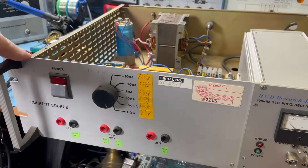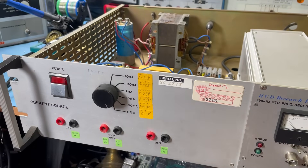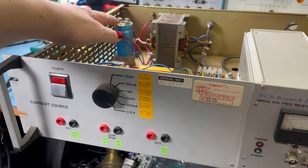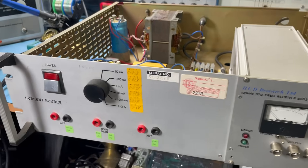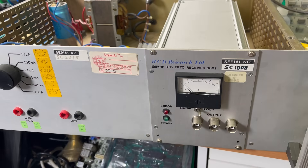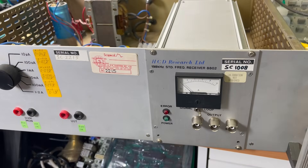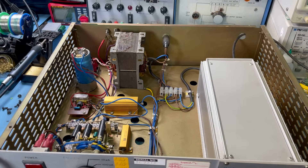Shame they're switching it off soon. So I've already got it over on the bench. I've got the lid off — let's dive in and take a look at what I've got. It's a rack-mounted current source. Seems all right. I'm literally just checking it over to see if it's safe to power it up. A few little issues — we've got a weepy capacitor there. Just checking the soldering on the back of this board; it all seems a bit non-standard. It's got this standard frequency receiver complete with antennae, which needs a bit of love, but it's quite nicely made. There's some recycled parts in here — it's a bit of a homebrew job.